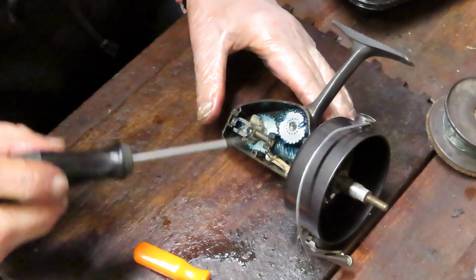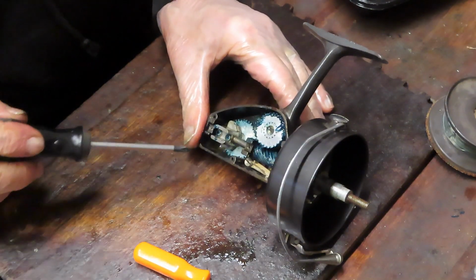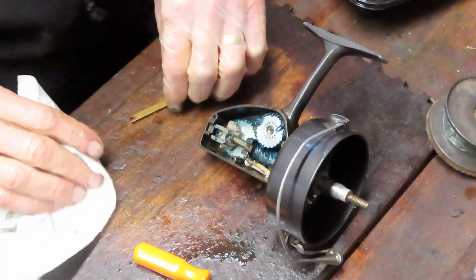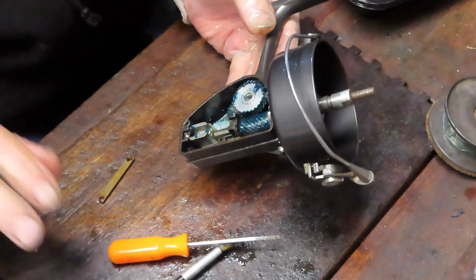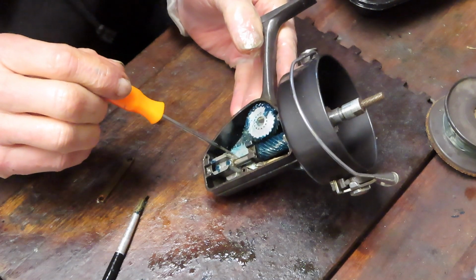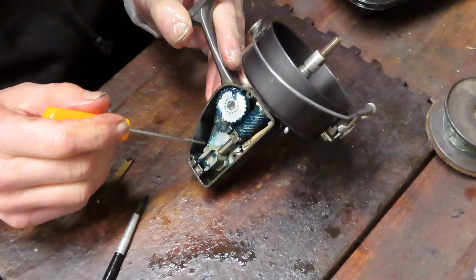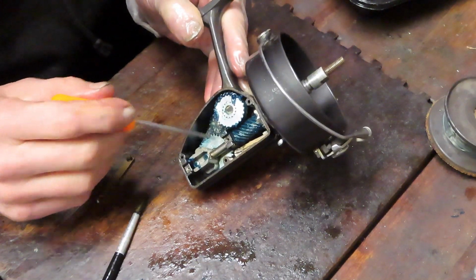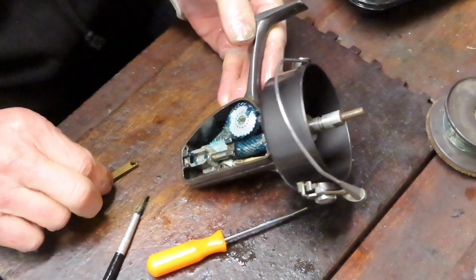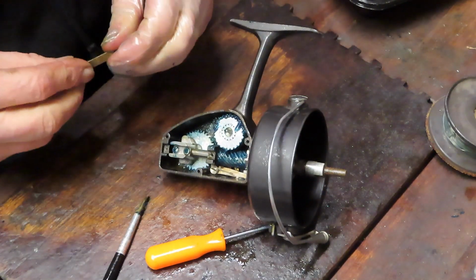Okay, well my video cut out. Hopefully we have a good transition point here, but I'm just tightening up the last of the screw pieces there for the oscillation block. I'm starting to mention that we want to make sure that when you load this oscillation block that this little ramp side is over here. It's very easy to put this one upside down if you didn't take a picture. This little ramp is protecting yourself from the drive over here. So you need to make sure that as you do that, the indented side belongs on the left-hand side of this. All right, bars next.